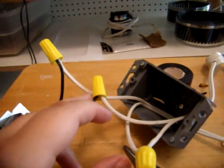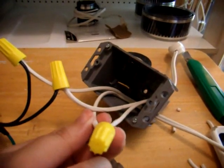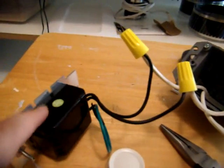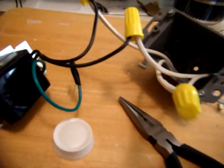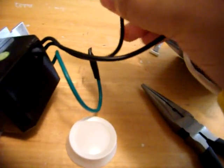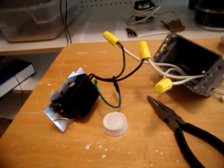As you can see, I have both of the ridged wires — one from each cord — connected to the black wires on the dimmer. Then the two smooth ones from each side go together with a wire nut. So you have the two negatives joined together, and the positives actually go to the dimmer. I taped up the ground since we're not going to be using it. You can use electrical tape inside the wire nuts, but I don't like to because sometimes the glue can cause problems if it gets hot. Make sure they're in there good enough so they won't pull apart.